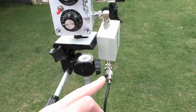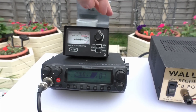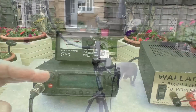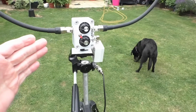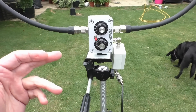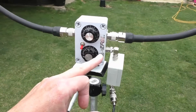With the balun removed it went over 9 on the meter, so the balun is slightly reducing it, but the SWR is still incredibly high. I'm not going to pretend I'm not a little bit disappointed — I was hoping to make this all in one video and perhaps even get a contact with the guys on the 305 using this antenna, but it's not going to happen on this video. The SWR is just too high. It feels like the bottom control needs a little bit more range of adjustment — it starts to come down and then runs out.